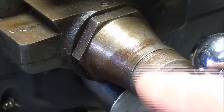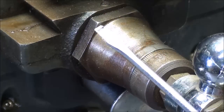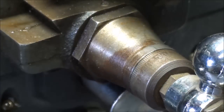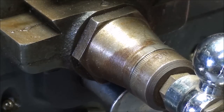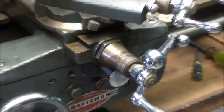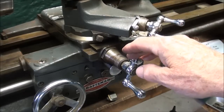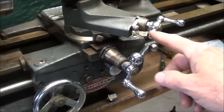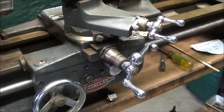In this particular case there's just a little slotted screw, but some lathes have a thumb screw that makes it a little easier to adjust. I haven't talked about backlash, but you need to avoid backlash in both your compound and your cross slide, which means you simply back it out and then feed it in, and never feed it out again without taking the backlash out. I've got a video on that too.